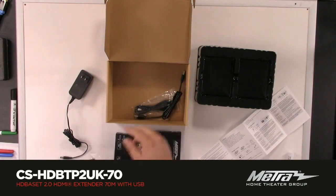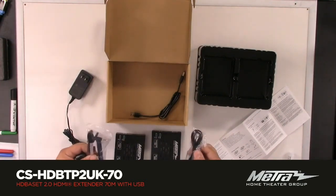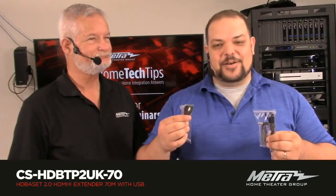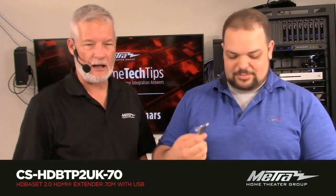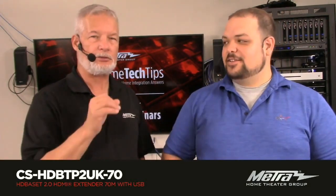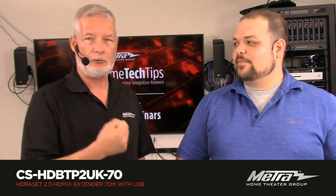Of course, you've got the IR receiver and the IR emitter. This is a two-way IR system, and it does use the 12 volt IR components. So what does that mean it's compatible with? It is compatible with all major control systems, including Control4 and Crestron. Xantech, Niles, SpeakerCraft. It is all standard compatibility with 2-pin for the emitters and a 3-pin stereo connection for the receivers.